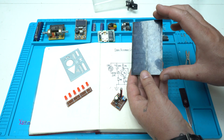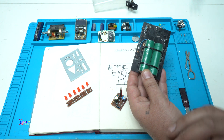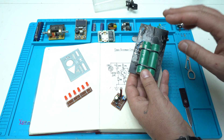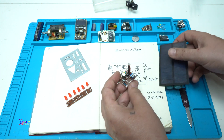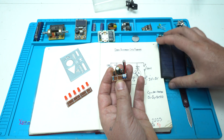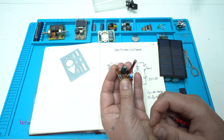From the solar panel we're going to charge the supercapacitors. I'm using two of them connected in series so I can get a higher voltage. Each of them is 2.7 volts, 100 farads, but because they are connected in series I will get 5.4 volts and 50 farads. The supercapacitors will act like a battery — the electricity will go directly to the electronic board that will detect darkness. This circuit will work only at night; at day the supercapacitor will be charged and at night the electronics will blink the LEDs, depending on the capacitor you choose for blinking speed.